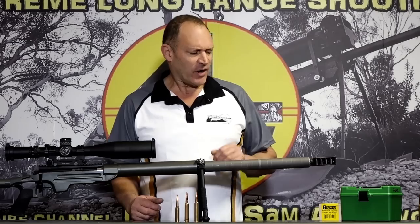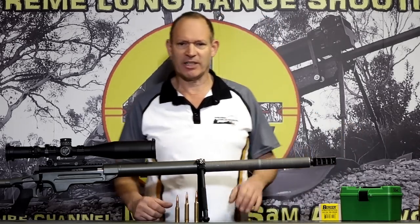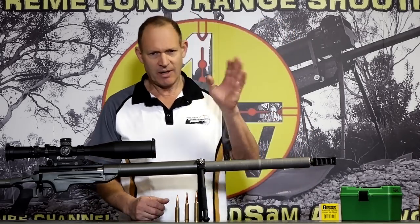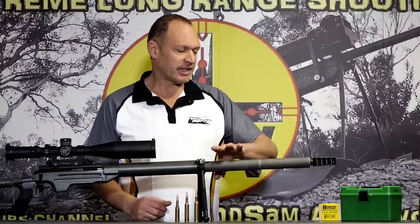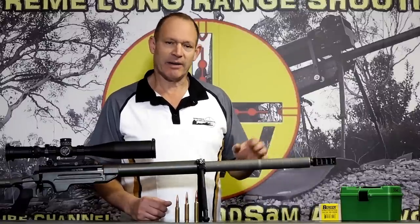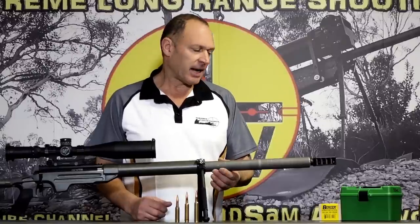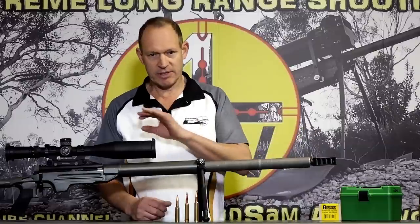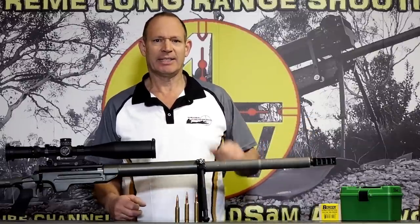But when I first shot it, there were clunks of sand on the back of the muzzle brake, and for an instant I thought, oh, wait a minute, is it the way I sealed it up with the problem? The instant after that I realized that the way this was finished is, once all the machining's done, they sandblast the thing on the outside to make it an even color, even coat. And that sandblasting went inside the tubes, not inside the barrel, which was thoroughly cleaned, but inside the tubes, which you can't really access properly, had sand in them.